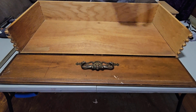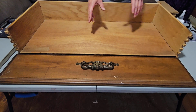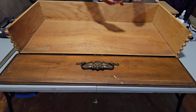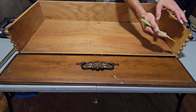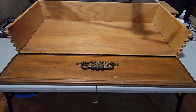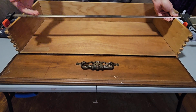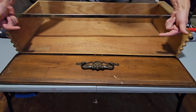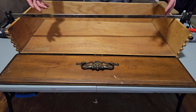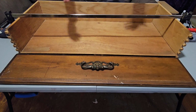The first thing you're really going to need, of course, is wood glue, but there are a couple of things that you can use to make this easier and to make it more effective. Number one is a paintbrush. So if you just have glue and paintbrush, you could get away with it. But another thing to help is a bar clamp, because it pulls this stuff tight together. After you put the joints in on the side of the face, you're going to squeeze it so that this way it locks in and all that, and this will hold while it all dries.